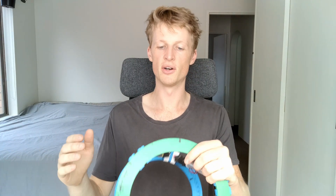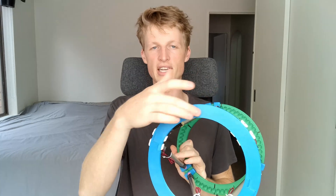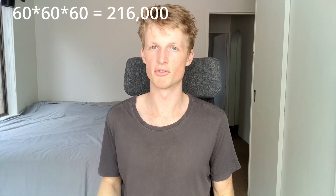There was one other variable I was not sure about: the ratio of the radius of the platform compared to the radius of the base — how big should the platform be compared to the base? So I added this as a variable to my simulation, giving a total of three variables: the angle of the platform legs, the angle of the base legs, and the ratio of the diameters. Each of these variables was tested over 60 increments and set to change independently of one another, giving the 216,000 simulations. After each geometry was tested, MATLAB saved the reach rate for that geometry, which allowed me to generate a plot.